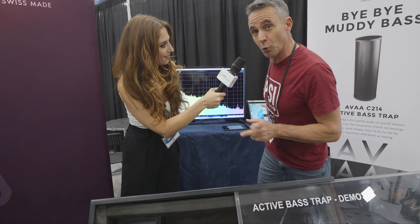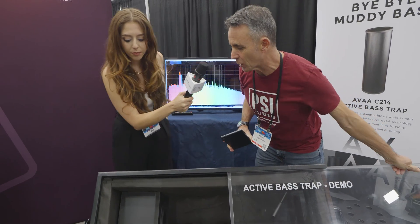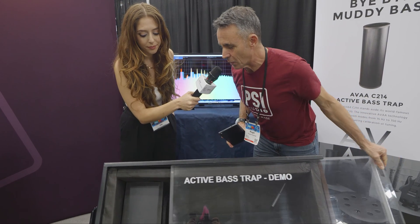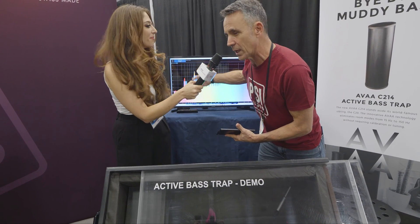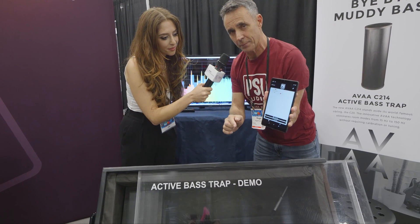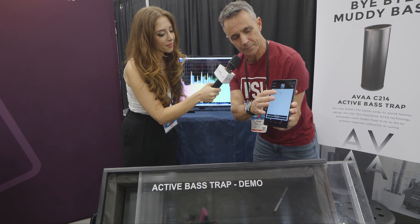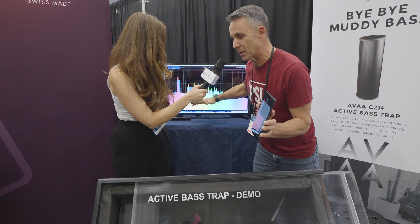Now I'm going to turn on a 48Hz tone. The room is open so there's not many room modes, but if you close it the whole thing starts vibrating quite a bit. You can see all the modes here that come up quite significantly. Now if you turn the absorber on with the remote control, you can get rid of all of this resonance — you can see them all coming down.